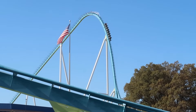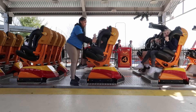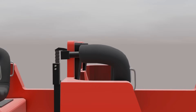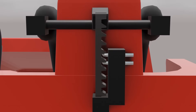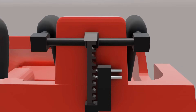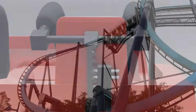More advanced versions, such as those found on B&M roller coasters, use a drum-like ratchet with several hammer pins. This restraint design does suffer from one flaw that has caused it to slowly fade away: it can only lock in a predetermined number of positions. On B&M rides, for example, there are eight different settings. If a rider does not fit one of these settings perfectly, they will have some play in their restraint. These restraints can also experience a problem known as a slipped ratchet, which occurs when the locking pins don't fully engage. Then, usually after the ride is started, the rider puts force on the restraint causing it to pop up into the next highest setting, making it feel like the restraint has temporarily released. This is more common when the ratchet device gets worn or when there is debris in the device.